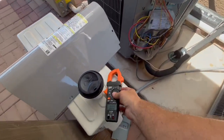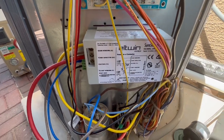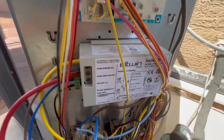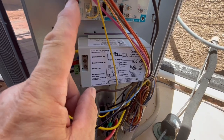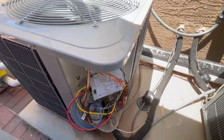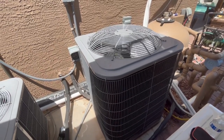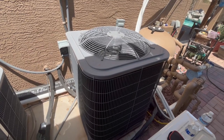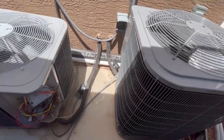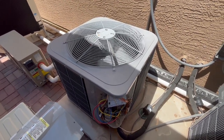Anyways, just want to let you know these hyper starts are well worth the money. I saw another one, but I couldn't find anywhere to buy it. Now the other thing about these is they sell them in 120 volt single phase that you can use on your motorhome, which I'm going to get. I'm also going to get one for this 4-ton so that it'll drop that down. I heard someone say the inrush on this is about 119 amps and it'll drop it down to about 45 amps. I like that. So a lot softer start. The compressor and stuff doesn't have to work so hard.